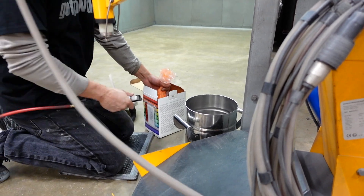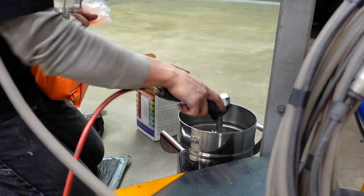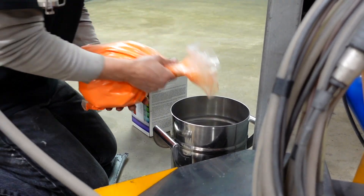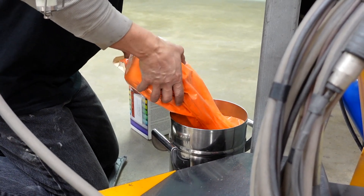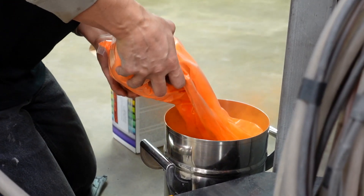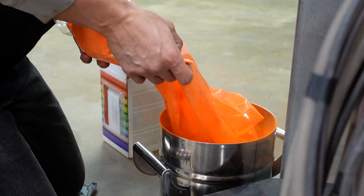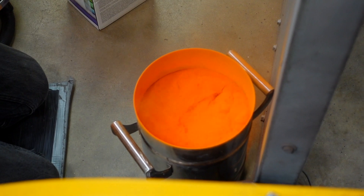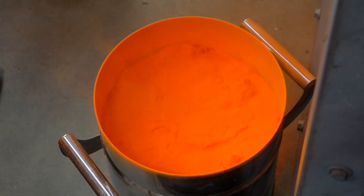Now it's time to get out the final color. Making sure all the equipment is pristine and clean, Dustin has a special system for the powder coating that keeps it aerated, versus just dropping a box down on the floor and sucking out of the box. Here's the color I picked for that tail empennage section. He fills it up and once the machine gets turned on it almost looks like lava — it's basically aerating the powder to get it real light and airy for the application process.